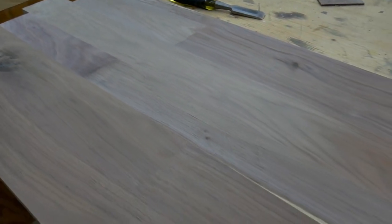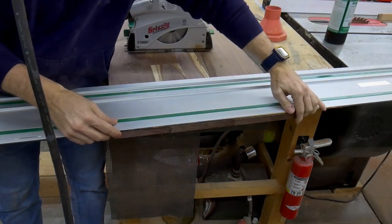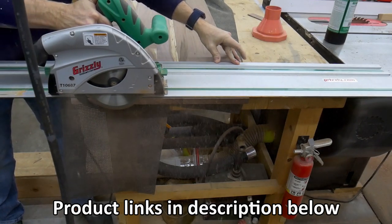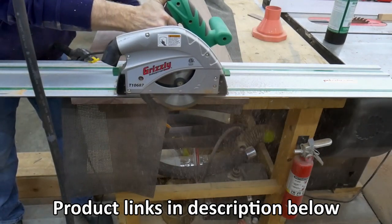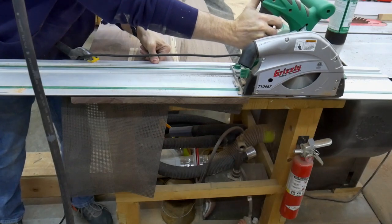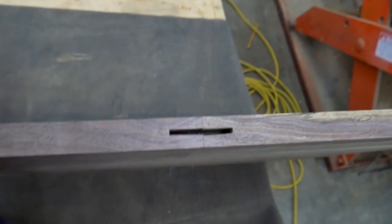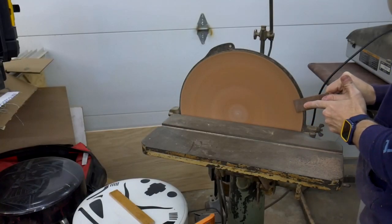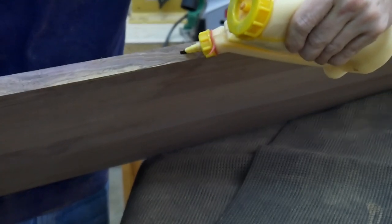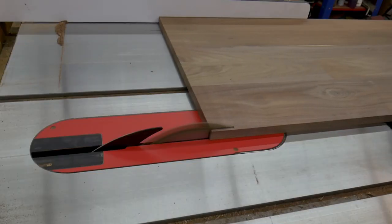Since the top is too big for my crosscut sled, I decided to break out the track saw for this operation. First I mark where I want the saw to cut, then I line the track up to the mark and cut my ends perfectly square. This Grizzly track saw is super affordable and does just as good a job as the other brands out there. I do have a hole that will show up on the finished piece, so I use a piece of spline material and shape it on my disc sander until it makes a tight fit into the hole, then glue it in. Once dried, I trim the desktop to final width using the table saw.